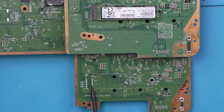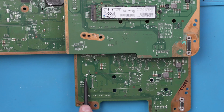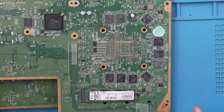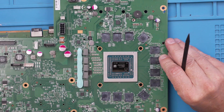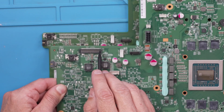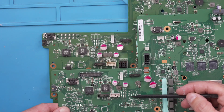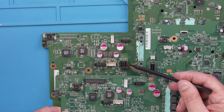On the bottom is the retail version of the Xbox One X, and this is the developer version. It shows the SSD with the port all populated for it, while on the retail version those parts just aren't populated. The other interesting thing is that the retail motherboard on the bottom doesn't have any extra RAM chips, but on the developer version it's got twice the amount of RAM — chips on both the bottom and the top. Also, the retail version has these pins here that don't have anything on them, while the developer version has a connector there. And the power supply connector location is different between the two versions.